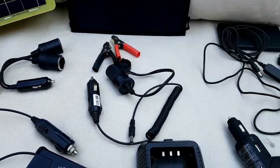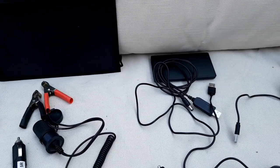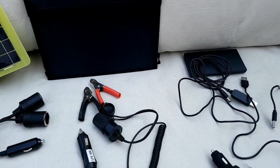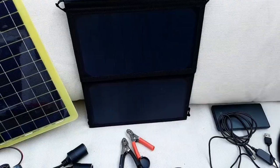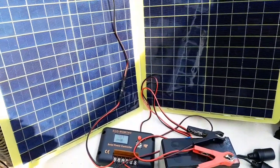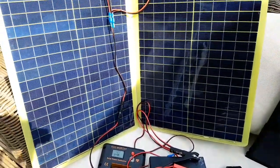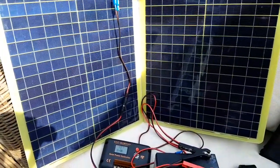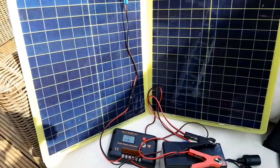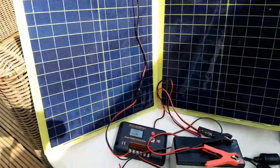So all these things need 12 volt, except the USB battery. But you can top up the USB battery from this, as long as it's fairly good weather, or from this. I've got two 20 watt solar panels. Basically I've piggybacked them together so it's 40 watt. If you buy one of these, I'll pop a link below, it comes with the controller.